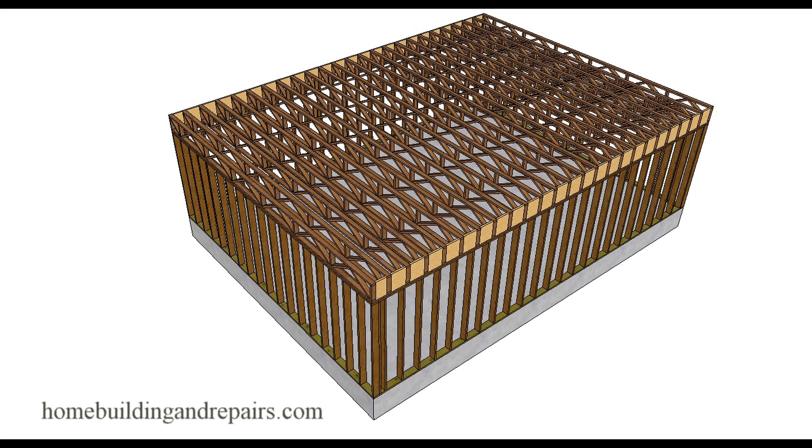In this video we are going to talk about 2x4 floor trusses and some of the problems you could run into if you are putting a stairway or a stairwell — some type of section in the floor that would require different size trusses. The first thing I want to point out is that if you order a specific size truss it usually cannot be cut.